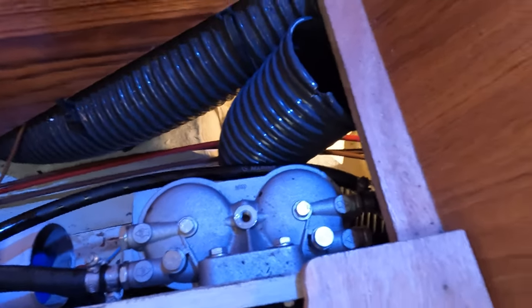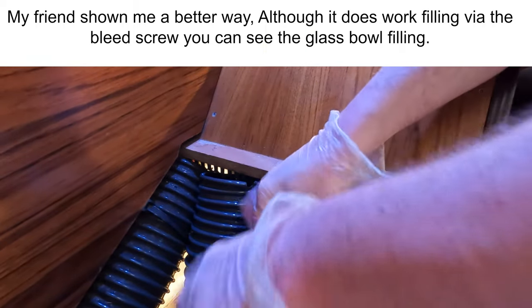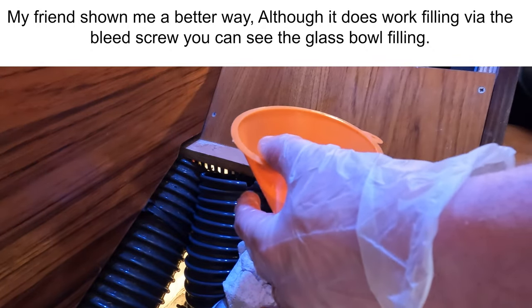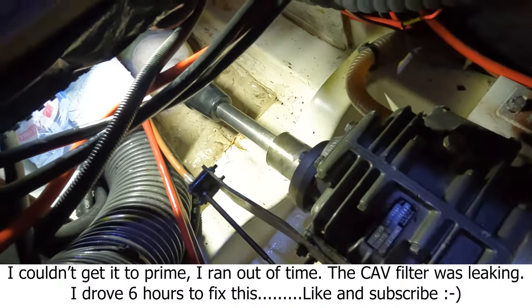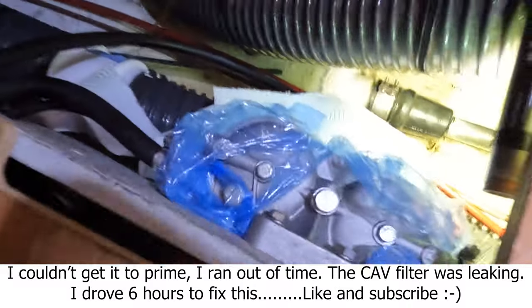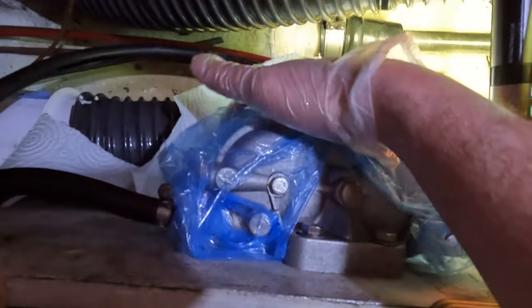Back to the inline filter. I'm going to pre-fill them using the blue bleed screw. The way I'm going to do that is a tissue around the middle bit and a filter. I'm going to slowly fill it up and that's going to fill both of the cartridges. Now I've tidied up the area. I've put the new seals on — I disassembled both of them and put new seals on. I've also put a plastic sandwich bag on each side of them so I can see if anything leaks.